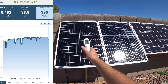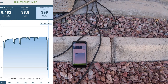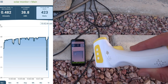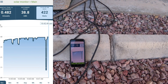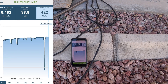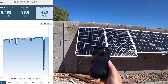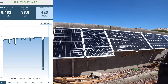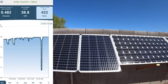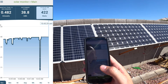Already the efficiency has increased 25%, and it's still going up — at 422 watts and climbing. I've achieved 500 watts on panels that were supposed to be 550, just by cooling them off. In wintertime, I got 600 out of 550-watt panels because they were so cool. The problem today is we're stuck around 422 because it's a miserably hot day, and evaporation just cannot bring them under 80 degrees. That little cooling — from 120 or 130 degrees down to 80 — made a huge difference. We're easily pushing 422 watts instead of the initial 333.